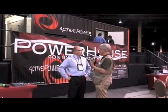There are essentially four sections to it, but three sections physically here on the powerhouse we're looking at right now. There's the generator itself — a standby diesel generator with a fuel tank. There's also the switchgear, the transfer switch section which handles all the distribution of power, and then finally the flywheel UPS itself. The external part is the air-cooled chiller that cools it.